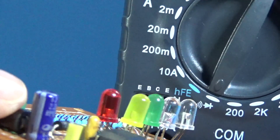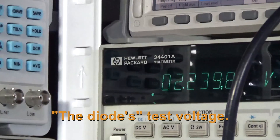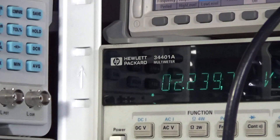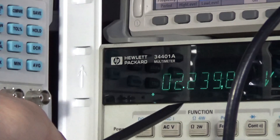Maybe some of you will not be so happy because I cannot test the blue and white LEDs. But in my case it makes me happy and I'll explain why: the output voltage is very low, around 2.20 volts. If I use more than 3 volts to test LEDs it's nice for LEDs, but the voltage could be harmful for sensitive circuits. Nowadays digital electronics work at 1.8 volts, so I can use this multimeter for voltage-sensitive work. Not all my multimeters are low voltage, so in my case I take it as an advantage — I need to know my equipment.